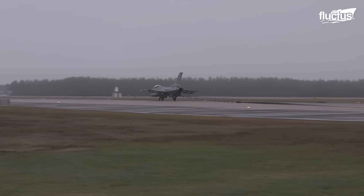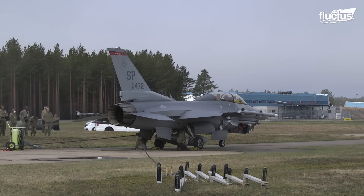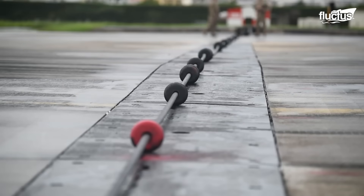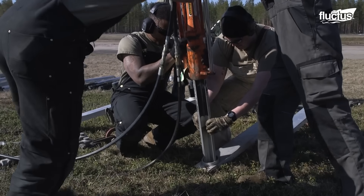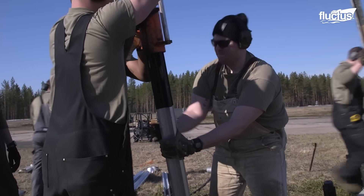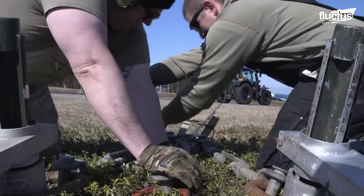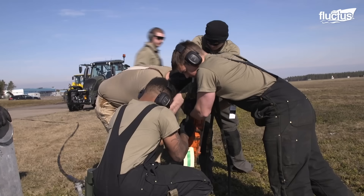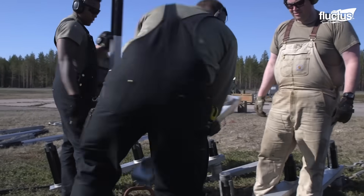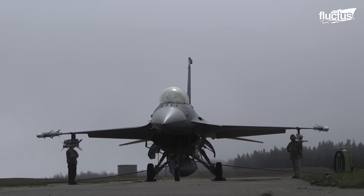With the use of Expedient Trim Pads, fighters are put to the test while resting on an existing runway. The anchor system has a restraining cable laid across the runway and is connected to two anchor groups on either side. An anchor group is a collection of individual anchor stakes. Usually, an anchor group has 12 stakes anchored in a triangular shape and connected to a triple turnbuckle fitting. The tail hook is engaged to the cable during the run-up, as the cable holds the aircraft in place.